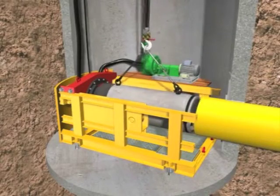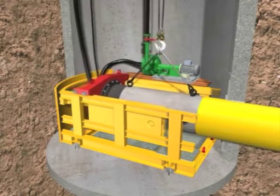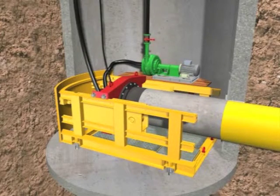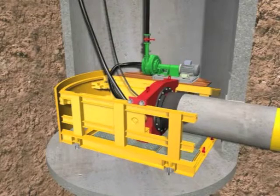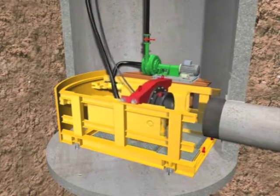The product pipes are lowered into the shaft one after the other and connected with snap connectors. The jacking frame works in three stages. After approximately one-third of the maximum piston stroke, the jacking arms return and the main thrust ring of the jack can advance further. After jacking the product pipe, the connecting hoses, which connect the TBM to the container, are disconnected.